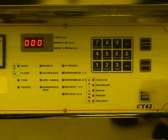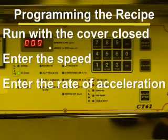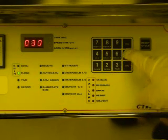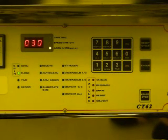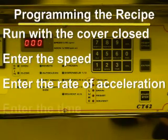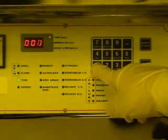Press the enter button once the speed has been selected. The system will then prompt you to perform the third step, which is to enter the rate of acceleration. The product of the number you enter multiplied by 100 is the rate at which the chuck accelerates in RPM. Press the enter button once the rate of acceleration has been selected. The fourth and final step is to enter the amount of time you want the process to run. To do this, you must first press the 3 button on the numeric keypad. An LED light will begin to flash indicating that you have entered the time mode. Press the enter button, then enter the time in seconds and press enter again.